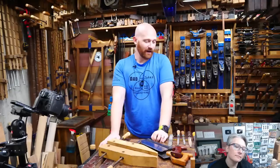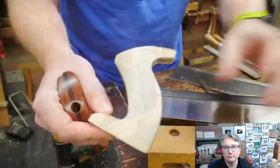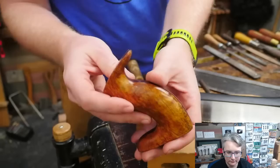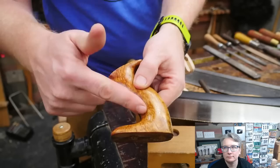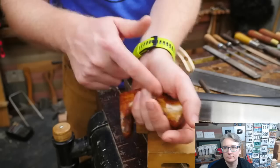Let's dive into the talk tonight. What I've got here is a tote I'm currently working on for a plane. This is an organic-shaped handle — the curvature here is not the same as the curvature here, and all the way along this, the radius of that curvature changes. That's because your hand changes — it's designed to fit your hand. Where your hand comes into contact at different places, it's rounded differently.